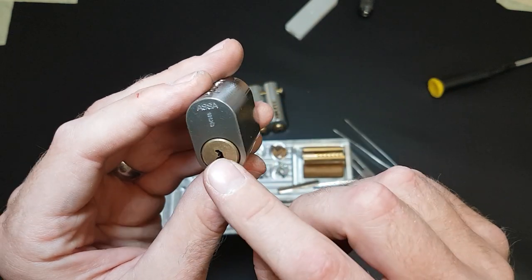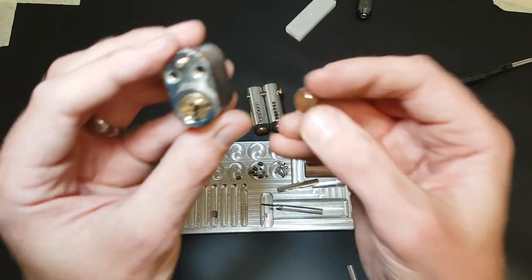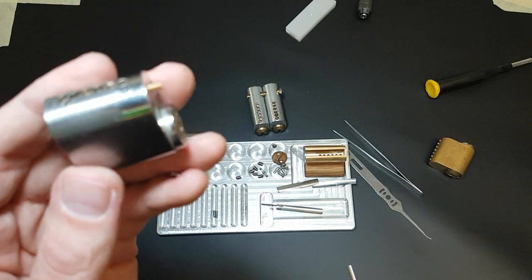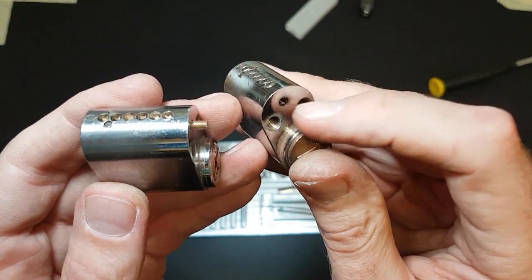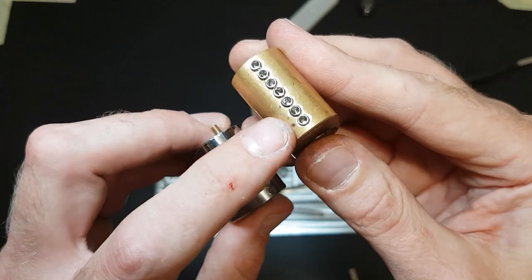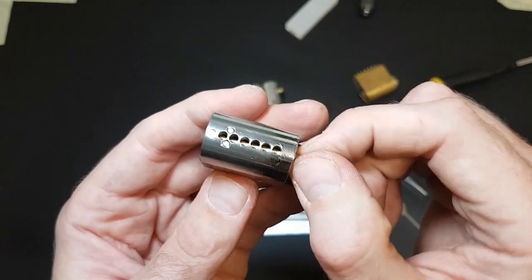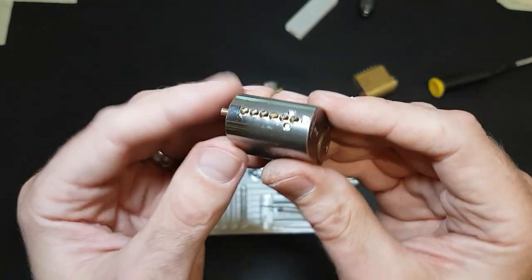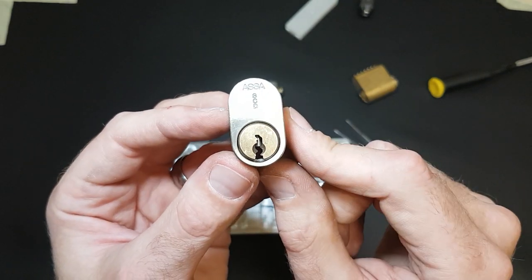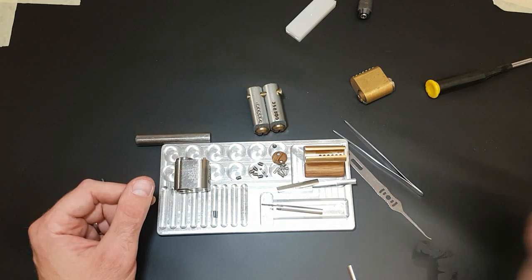So I'm going to find that extra spring and pop this back plate on as well, and then this one is ready to go. If you've got one of these Assa cylinders - I've got a couple here, this is another Twin Combi and it's got the same hole at the back - if you can find one with this hole at the back it makes it very easy to convert into a training cylinder, certainly a lot easier than threading all of these and getting the grub screws. Kevin, this lock is coming your way soon - you can start off one pin at a time and soon you'll be smashing through all six Assa barrels and maybe the sidebar. Who knows? Anyway, that's all for today. Thanks for watching and I'll see you on the next one.